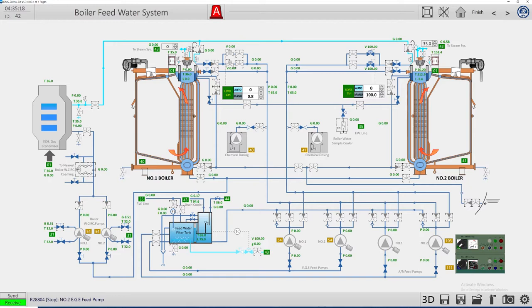At lower pressures you can start to associate the circulating pumps with the exhaust gas economizer so it will start to heat up. Once we start the water circulating pumps, the temperature of the system will drop, which is why we need the boiler running for a longer time. We'll set one small feed pump and one large feed pump for the boiler, then open the return lines so everything is ready for both boilers.